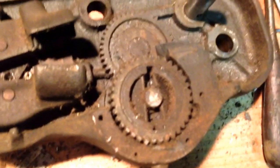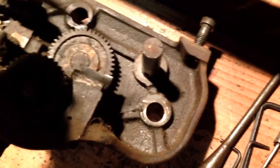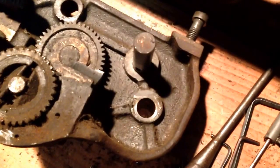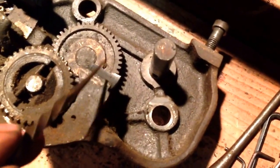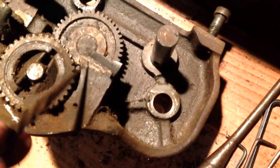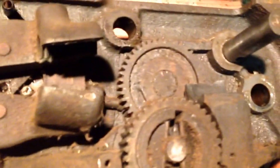I know Keith Fenner did a video talking about dam brazing, where he actually made graphite parts in the lathe and put those in there, and it brazed around that, and the graphite dammed it up, and then he could remove that graphite afterwards. Kind of like they do with Babbitt, just pouring it around a mandrel. But anyhow, I'm thinking probably the best way to go here is to cut this off, get in there, make it nice and flat, and then make a part to go in there and hold this worm in place.